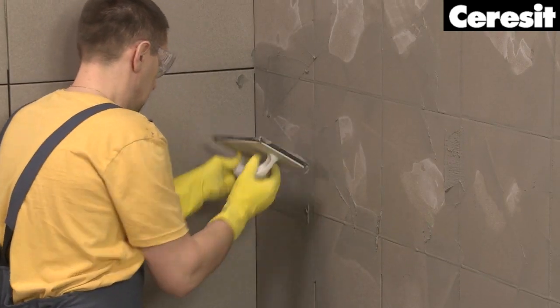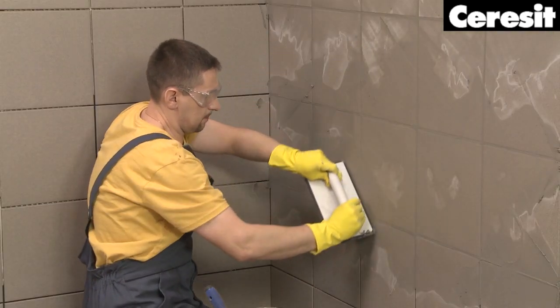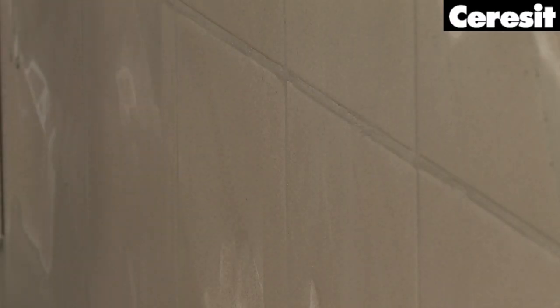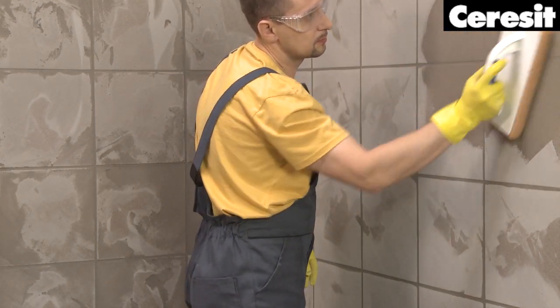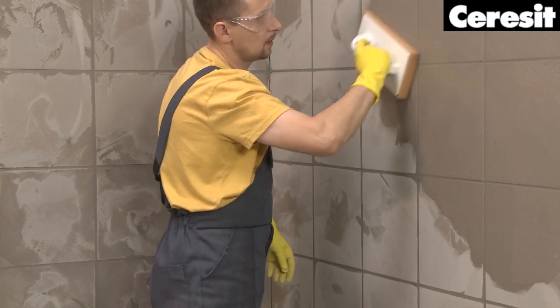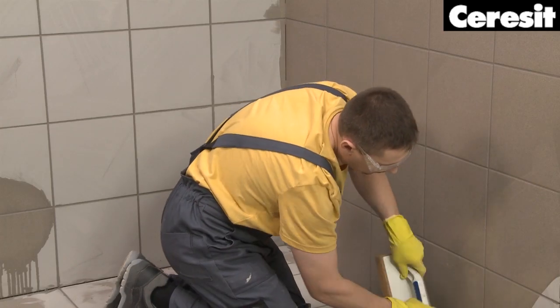Apply CE 79 into the clean, dry joints and make sure that the joints are completely filled. Remove any excess material by skimming it diagonally off the tile surface with the float. Epoxy grouts must be washed in three steps. First, emulsify the tile surface with a wetted hydro grout sponge in circular movements and remove the resulting slurry. If needed, the joint surface can then be leveled and smoothened by gently wiping it with a soft sponge. When the grout has started to set, clean the joints with a frequently rinsed soft sponge and little water.